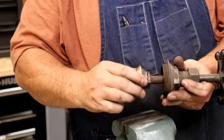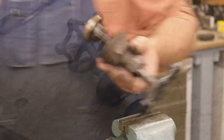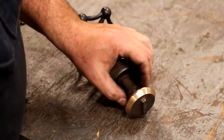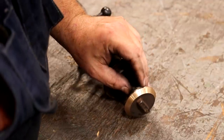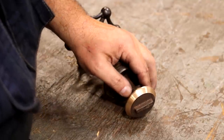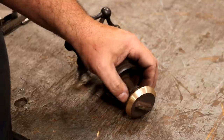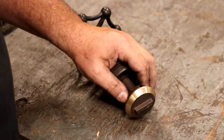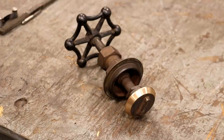With that, I think we are finished up. New valve seat, valve's on there, I think we're good to go. So I'll call Greg up and let him know this thing's ready to pick up. Just another look here — it all looks good. You can see that was one of the areas that I built up right there. You can see a little bit of a color difference between the two materials, so it's probably not a perfect match, but close enough. You can kind of see that little bit of a copper tint to it. This Monel material is a nickel-copper alloy, so it has kind of a little bit of a copper look to it, but it's primarily nickel. I think that's going to work fine for him.